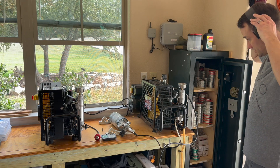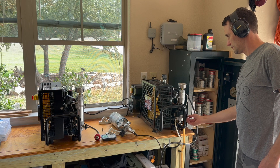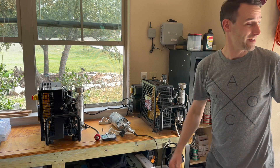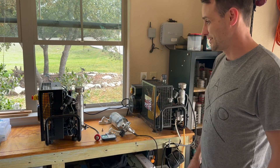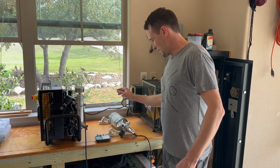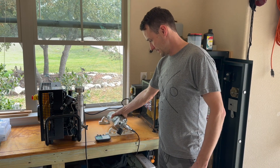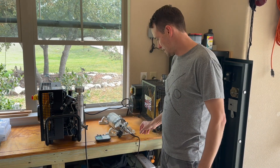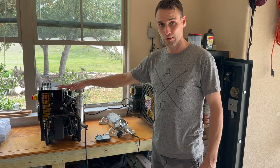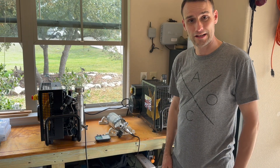This is my unit I've been using forever, so I do have some built-in drains, but it will still be a little loud. It's nice — I have it vented outside my garage, so if the garage door is closed it goes right out. I've drained this 100-cubic-inch tank down to 150 bar and let it sit for about 10 minutes to equalize and cool off. I've reconnected it to the new low-consumption MCH3 and let's see how long it takes to fill up to 300 bar.